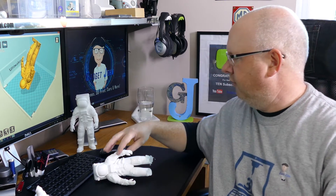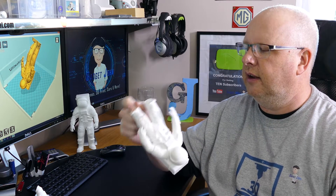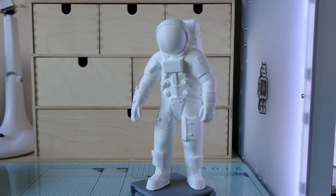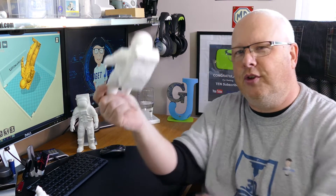I looked at the short belts — they were fine. The long belts had a little bit of play, so I thought maybe they needed adjusting. But they're not really adjustable because the pivot points for each axis are built into the chassis and can't move. The pulley cogs themselves can be tightened, so I went around with the Allen key and made sure everything was properly tightened. Then I started the next print. After 19 hours it got quite far and then shifted again right at the top — roughly three or four hours from finishing on what was essentially a 24-hour print.